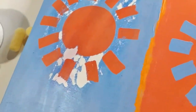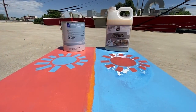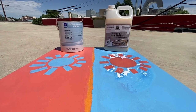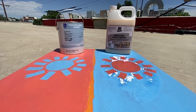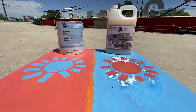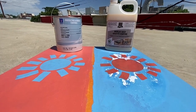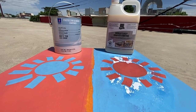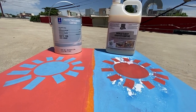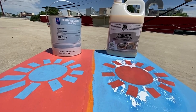I'll have the different products linked in the description, but you can clearly see the difference between sacrificial and non-sacrificial. If you have limited equipment, the permanent non-sacrificial anti-graffiti coating works well. If you have access to a lot of equipment like a power washer, the sacrificial one works out too. Hopefully this video helped you understand what these products do and how they can be used in your practice. Definitely try it out — I'll see you next time. Peace.